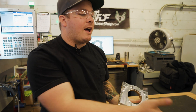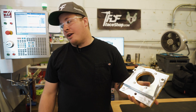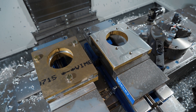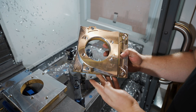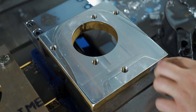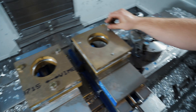Since we've already run through a couple pairs of caliper brackets through op one, this is what it looks like. We're just going to show you how we load this onto our fixture plates and then run through op two. We have our fixture plates for our left-hand and right-hand sitting in the vises. Our left hand is already mounted up and bolted down to the fixture. Here we're showing an example of our tabs again — on the fixture plate the tabs will bolt in. You can see the contour of where the end mill is blending in along the fixture plate.